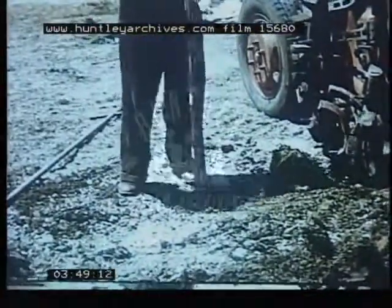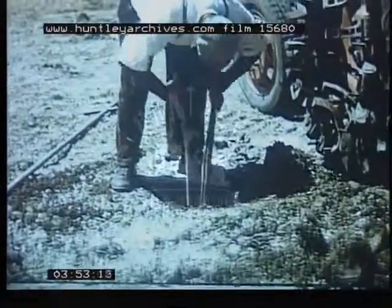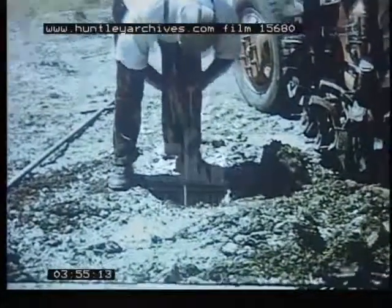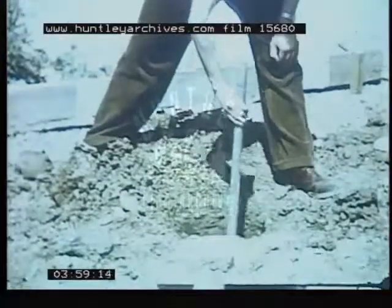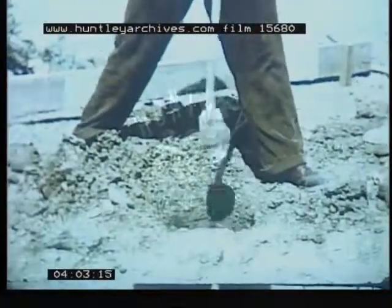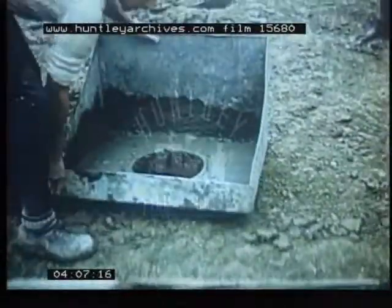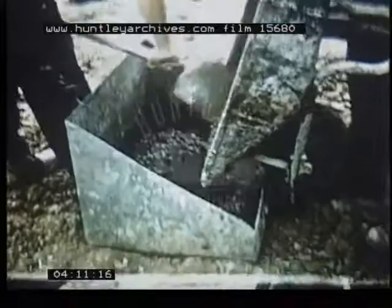The loose crumbs of soil left in the hole have to be cleared with tools designed for the purpose, and the bottom of the hole is rammed. Concrete is then poured using the hoppers to exclude loose soil. The concrete should be well rodded to ensure that the hole is completely filled up to the roof of the under reaming.